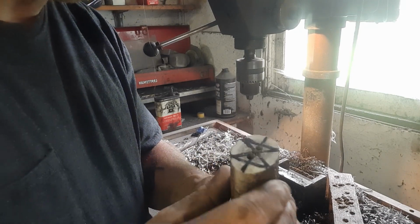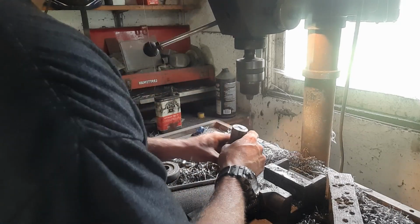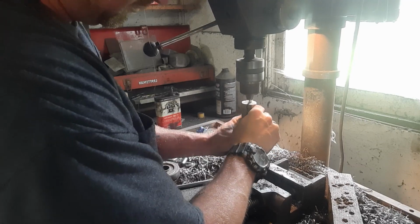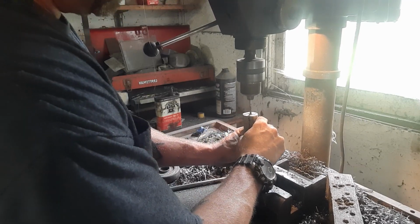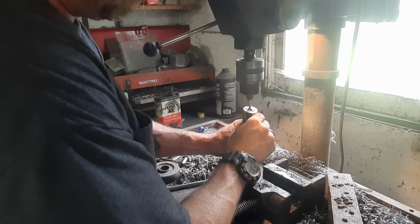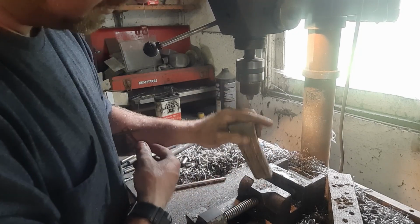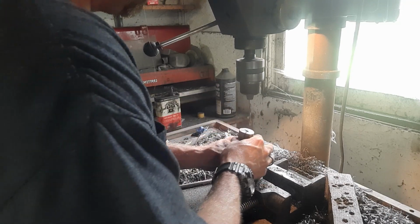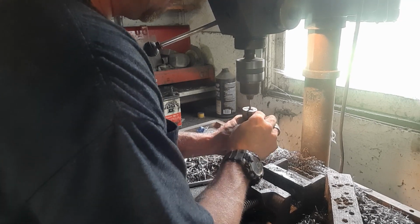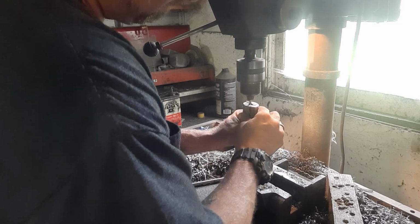We got them drilled in, and there's a quick way of getting some of the material out. Use the drill bit. Start in the center and just work your way back and forth like you would a piece of wood. That'll help get you started on the tang to go in. Now it removes material a little at a time. All right, you broke through the bottom.